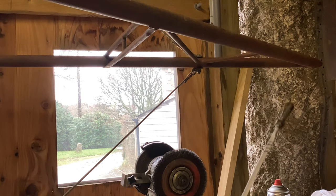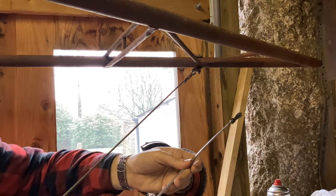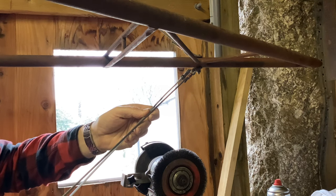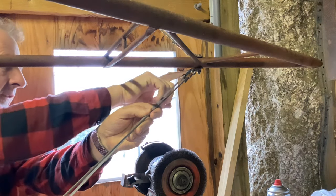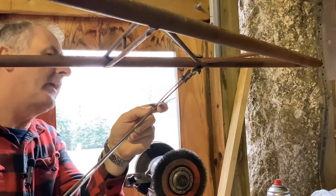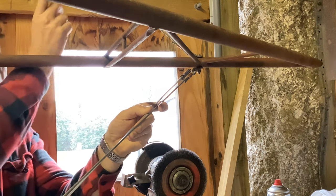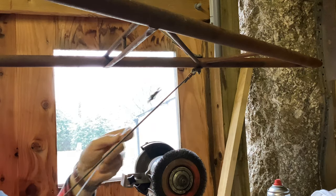So now I've got not only a flying wire to garotte myself on as I go through here, but also the camera to bang my head on. I'll show you — if I clip the bottom fork end on the little bolt that's coming through, you can see the wire is about the right length, with a little more adjustment still. These tangs are 1 inch hole centre; when I measured up the Aeronca C3 ones at the hangar, they are 7/8 of an inch. These wires all sit very nicely and all the cable tangs appear to need about a 7/8 centre — so that's what I shall make.